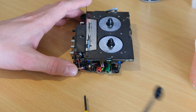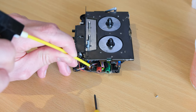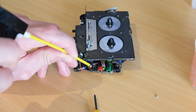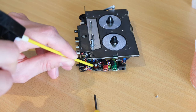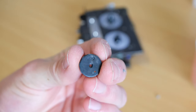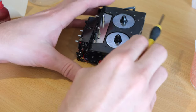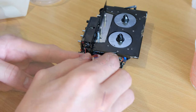I pop the gear off — forget that, it always flies away. I'm going to use some Deoxit — this is a spray applicator and I'm being very careful not to spray the whole inside of the Walkman because it's also some sort of lubricant and you don't want that on the belt or running gear. I'm just dripping that around the pot for the volume knob — not too much, just a little bit enough to wick into the shaft of the pot. The volume knob itself is keyed, so I put it on, push it down, then turn the knob all the way to zero so it's in the correct position. The screw goes back in and I'm going to put a little bit of blue Loctite on there to stop the screw backing out.